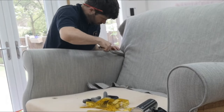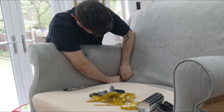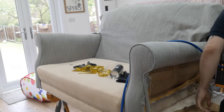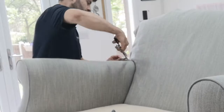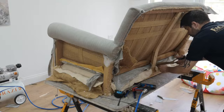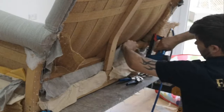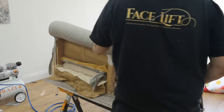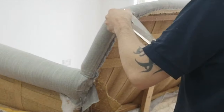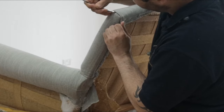What I'm doing here is putting the fabric on and then cutting around the wooden rails. With a wooden rail you lay the fabric on nice and flat, make sure it's in the right position, go up to the rail, cut a V into the wood, then pull the fabric either side and fold a little bit under. Here I'm doing the corner pleats — manipulating the fabric, pulling it nice and tight, putting some temporaries in, getting rid of all the excess fabric, using my regulator to push the excess fabric so it sits nice and flat, then staple off.